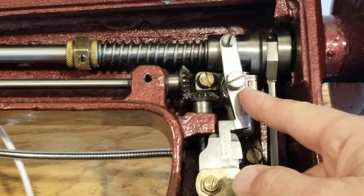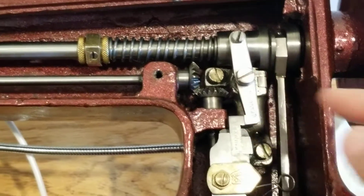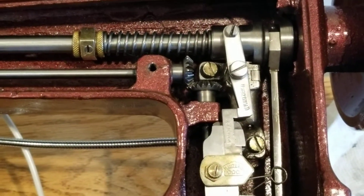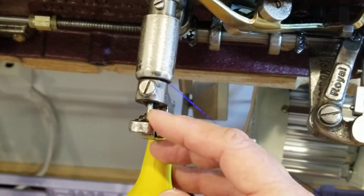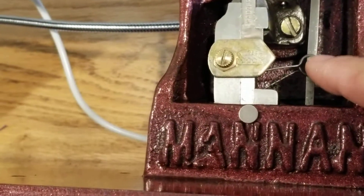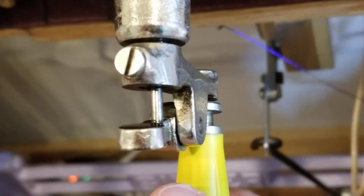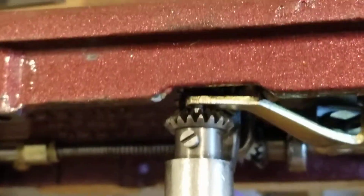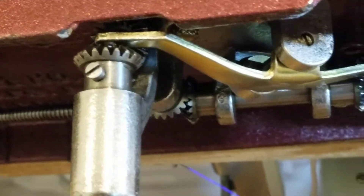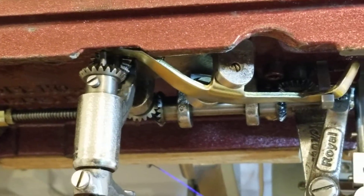Many people with vintage machines, this piece here — maybe this screw might be there, it might not — will just be gone. But if you are buying a newer machine, most of them come with the stop-motion, which is this. The handle has a small rod inside and then there's a little spring. You can see this spring right here that makes this metal piece go up and down. So there's a rod inside the handle. When you pull down on the handle, this rod right here goes up and down, and this piece here is engaging and disengaging your stop-motion.